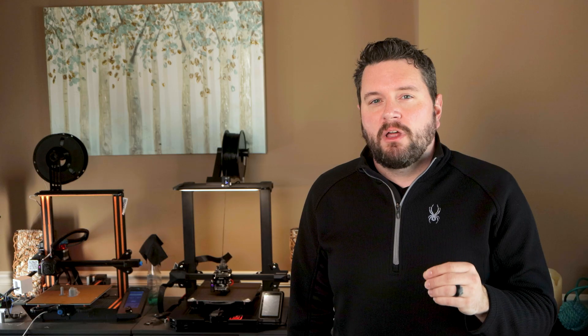This is super important: please make sure you check the power supply switch on the back of the printer before plugging it in. Mine was shipped with a US plug but was still set to 220-volt mode. They have it covered in a sticker, but I would have almost preferred the sticker cover the AC plug just to make sure users check this before plugging it in.